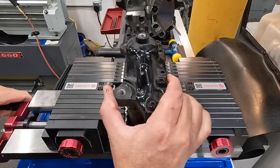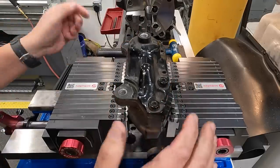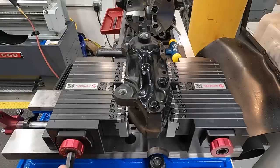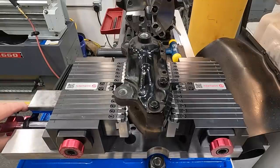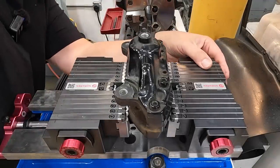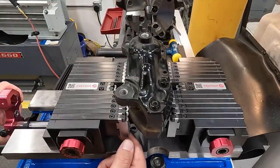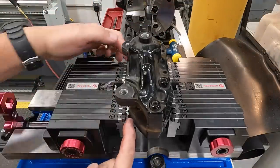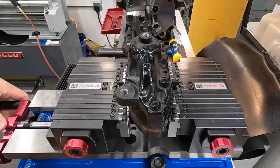Go back a little bit. All right, I think I need to put a little bit more pressure on the bolts. Once we get this where we want it, these are actually torqued to 65 foot-pounds so that they have the right amount of pressure on them. Give a little bit more pressure. I'm watching these guys push back so that they're all touching, I believe. Snug that one a little bit more, and tell you what, let's tighten that one up a little bit more. I want to try to get these to move so that these outer ones can come in and catch more of this caliper here. That one's not doing it, but this one on the other side is.